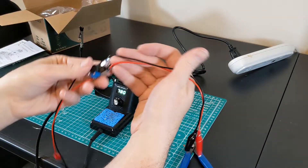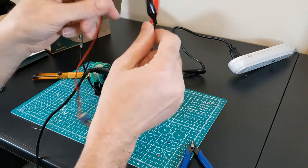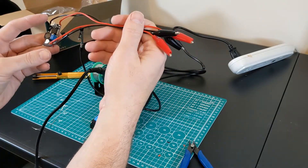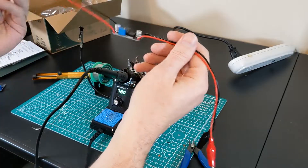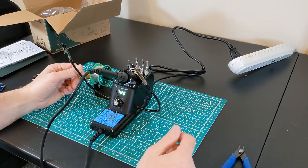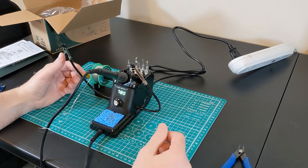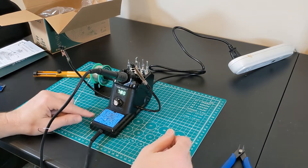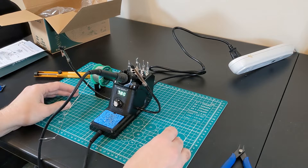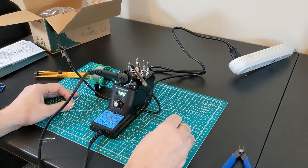I'll just take a piece of heat shrink, slide it over, and cut a hole out for the pot adjustment — and that'll be my DC to DC converter voltage adjuster for hobby projects. If I need 5 volts, 7 volts, or 9 volts, I just put in something higher and adjust out what I need. So for under 50 bucks this thing is fabulous. I have no complaints — this is going to be my new soldering station. I like it. If this video helped you out, please subscribe, leave a comment, or use the link below and buy one of these for yourself on Amazon.